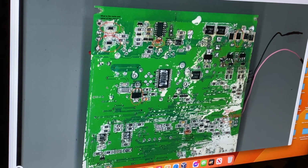I think that's, God, here we go. I think it's an 8.2 volt Zener. It's something like that. It's not a high voltage Zener. It's probably just put there to give this floating chip a clamped operating voltage. So 8.2 volts rings a bell.